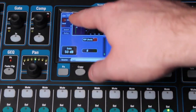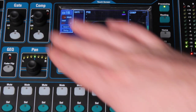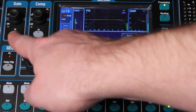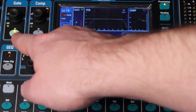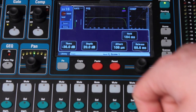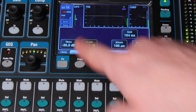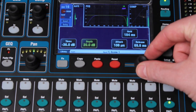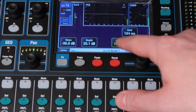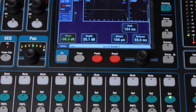Moving on, you've got the gate section, and the majority of your controls for the noise gate and the compressor will be here. The knob itself gives you the threshold for the noise gate, and of course you can turn it on and off. Whatever particular parameter you need to change, touch the parameter and you'll see it turns yellow, then this knob here will adjust that parameter. The same applies for all controls: hold, attack, release, threshold. You can control the threshold from this or from the threshold knob in the section.